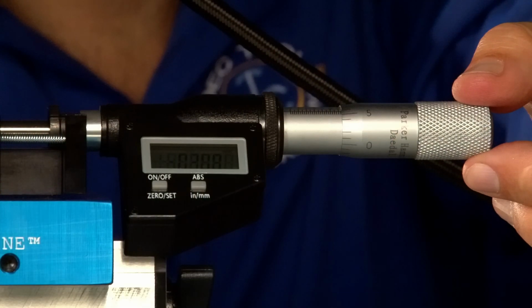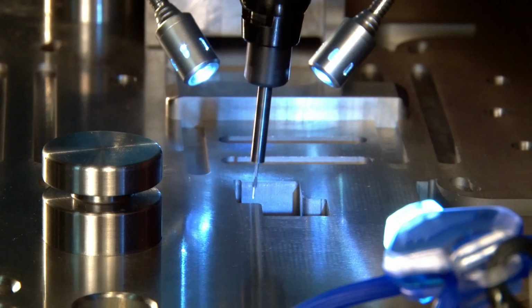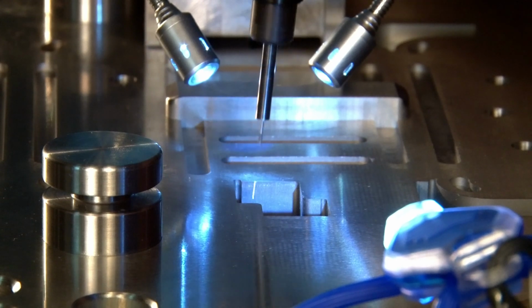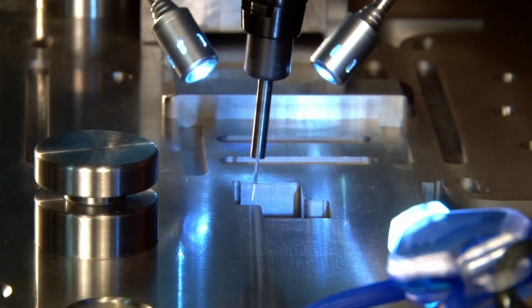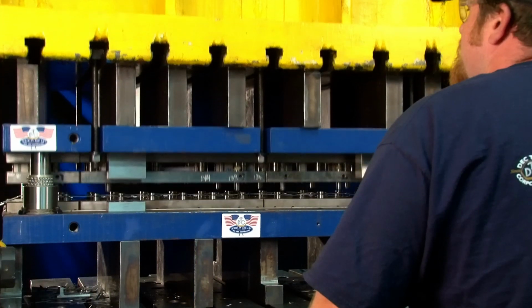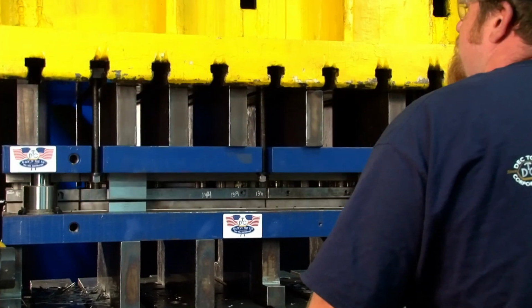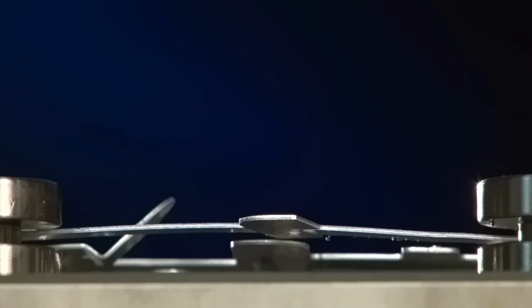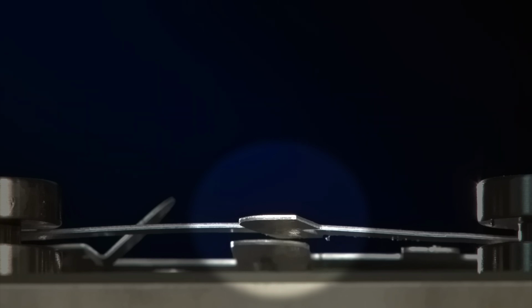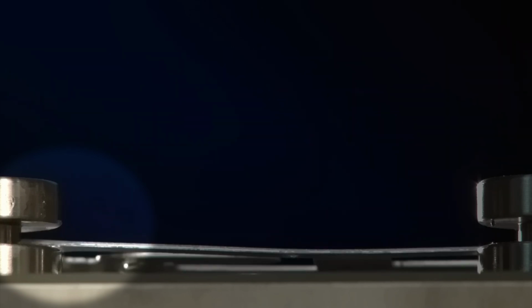A micrometer coupled to the drive of the machine's slide enables precise movement of the machine's carriage to enable the depth of the slug retention groove to be precisely controlled. The groove is machined to create an exact amount of interference. During the stamping operation, slugs expand into these precision grooves, which prevents them from pulling back up to the top of the die block and onto the die surface, where they can cause damage to the strip, the final part, even to the die itself.